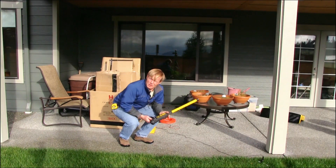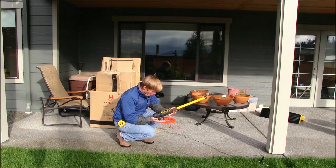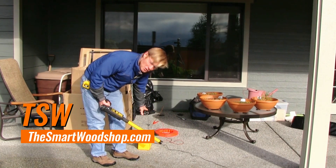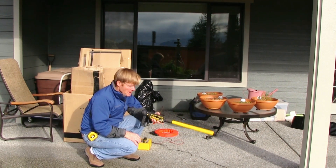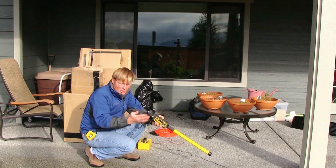Pipe horn is a very expensive tool, certainly not worth purchasing. It's one of those tools you want to rent from your local yard. It puts a signal into the line or conduit you're trying to locate, and then with this wand, you're able to go along and detect it under the slab or underground.